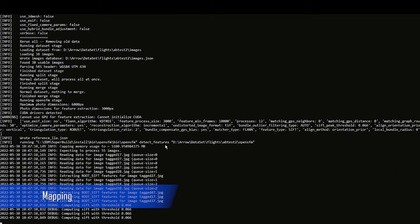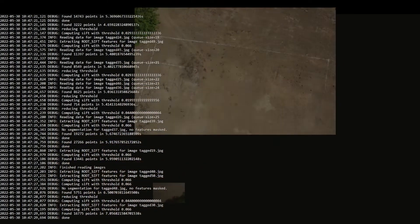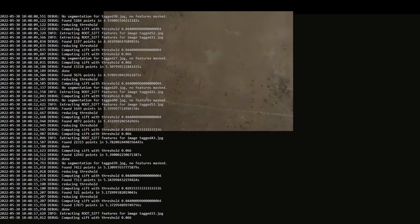The team developed an ODM-based mapping implementation. On average, a usable map is obtained in 7.2 ± 1 minutes. An inpainting technique was also developed in case of information loss and stitching errors, which works as a pre-processing step for the Mercator wrapper. The open-source ODM proves to be an industry standard, sufficient for the tournament's high standards.